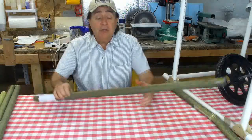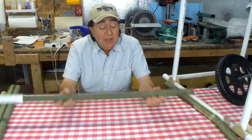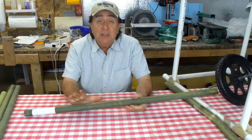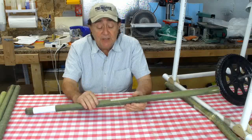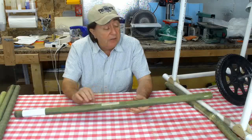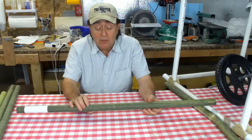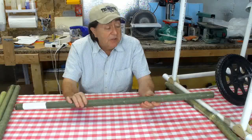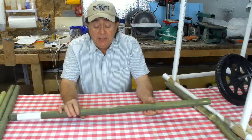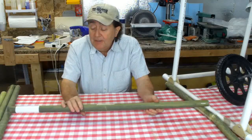Now, I also talked about the unidirectional carbon fiber that I had from TAP Plastics that didn't have so much scrim on it. It made a really nice tube. This has got a nice finish on the outside. It was much easier to work with. The Kevlar stayed lined up with the carbon fiber quite well, and resin worked out nice. There's a few spots where the Kevlar didn't stay wetted out perfectly, but this tube is way more than strong enough for any of the components on the pilot's cage. 1.6 ounces per foot, so ever so slightly less weight than that one.